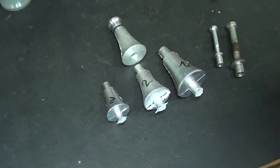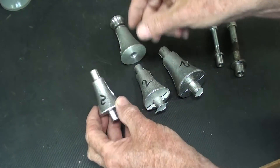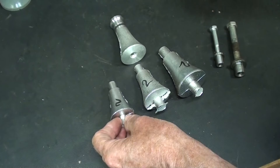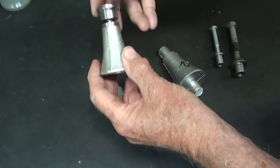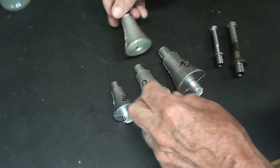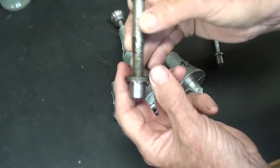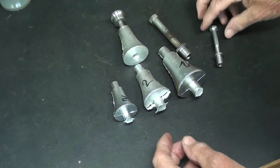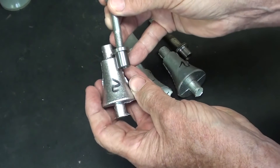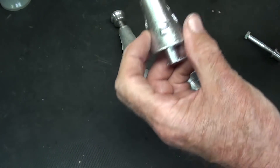I've cut the gates off these three. Since I've already made mama bear, I'm going to make baby bear. Through experimentation and common sense I determined that the thread for baby bear would be 5/16, the medium one 3/8, and the large one 1/2 inch — you can see I already made the nut for that. So I'll put the other stuff aside and we'll get started.